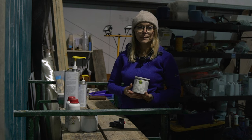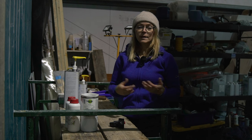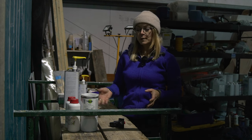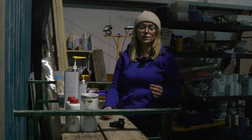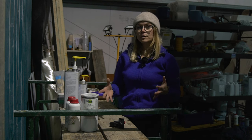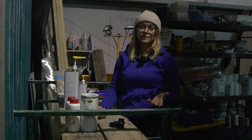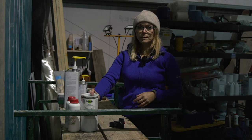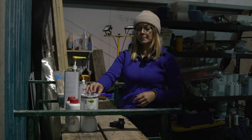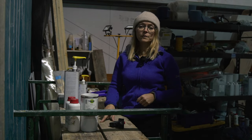The other foam that we showed you, which is the polyurethane foam, it's much easier to use. Well, it's a much shorter cure time, and it expands much quicker, and it doesn't require such high temperatures when it's curing. But it's not the one we want to use. This one is much more sort of rigid and stiff once it dries, but also Sicomin has better waterproofing capabilities.